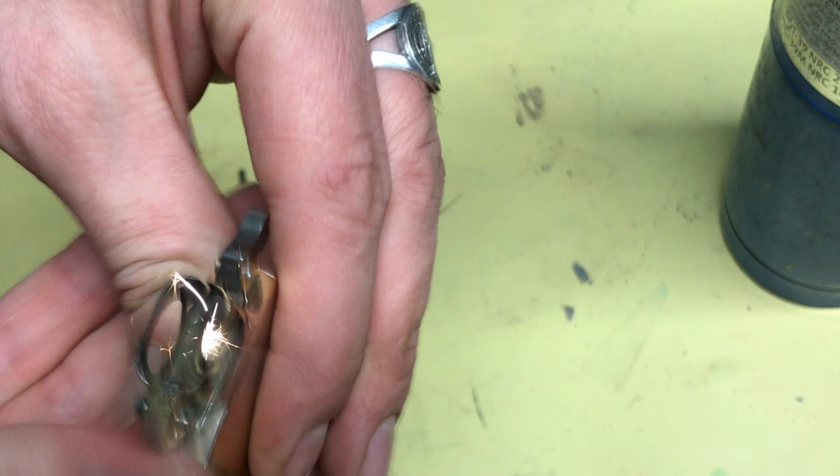I went over on a spot, and when that piece hits the flint, it will not strike. So what you will have to do is make sure you don't go over it. Try something smaller, be more delicate, be more accurate. Going over it with a wire wheel also will not get the brass off and will leave a coating from the wire wheel, and it also will not spark, so you cannot clean it with the wire wheel. I made that mistake. You just have to not get brass on the striker part.